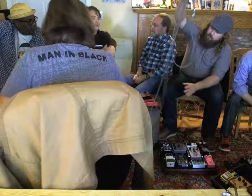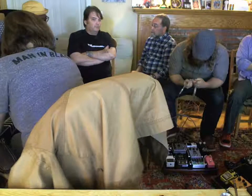But is that stuff available easily? Oh yeah, it's just a matter of money. Like I said, Mu Metal's expensive. Typically, big high wattage heads, if they have a reverb tank in the head, the reverb tank is so close to the transformers that you get hum. I always thought somebody ought to make some Mu Metal pieces that just tack on with Velcro or silicone adhesive. Literally just yesterday, I moved a reverb tank in a head up to the top of the head instead of the face of it, and the noise went down like 60%. But there's no eliminating it. There's no good spot for it.